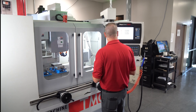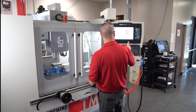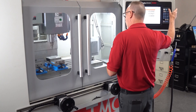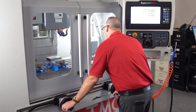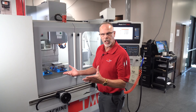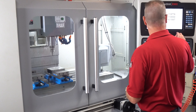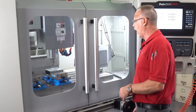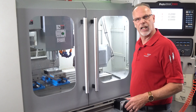There's also a feature where if I push stop, it allows me to use chip clear. In chip clear I can jog the machine out of the way, move it all around, clear out some chips — things like that. When I'm done, I can go back to resume, go right back into tracking, and it'll know exactly where it was when it left off to start machining again.